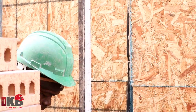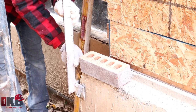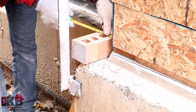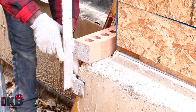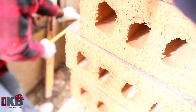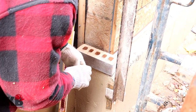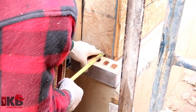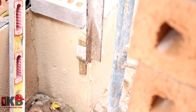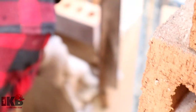Sometimes you've got to use something bigger. In my case I'm going to use something more substantial at the back around here instead of the brick ties. The reason for that is we want four and a half inches from the wall over. As you can see, the ledge here is a little bit less than this side — this side is three and a half, here it's like three inches — so from the wall out you want four and a half. This brick tie is a little bit too small, so we're going to use a piece of timber. Put a nail inside of it so that it won't move, and we're going to nail it in.